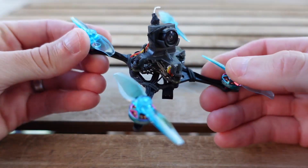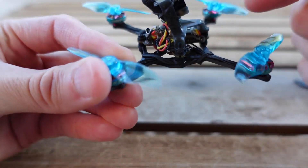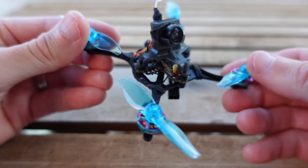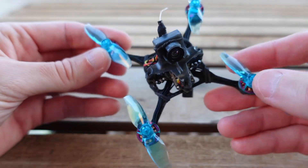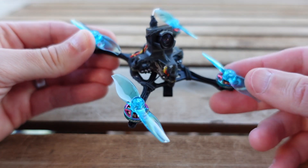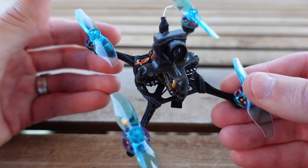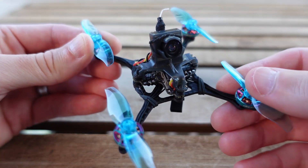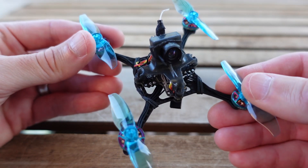I've got the Nubidrone BI canopy and the LDARC 199C camera. I could save a little weight because this board has a separate VTX and receiver. I'm flying on GNB 27 connectors, which are probably the best connector for this size, balancing weight and efficiency. I'll put this up on Rotor Build so you can see the full build. I do have a preset for a tune, but it's a starting point — not fully black box done. As soon as I have a 1S board with black box, hopefully TuneRC's board, I'll give you a proper black box tune.